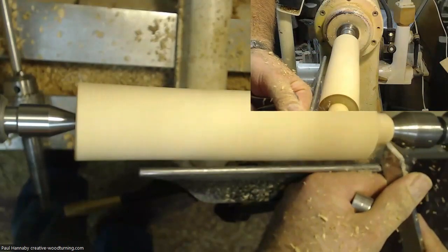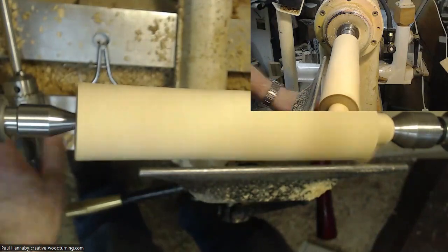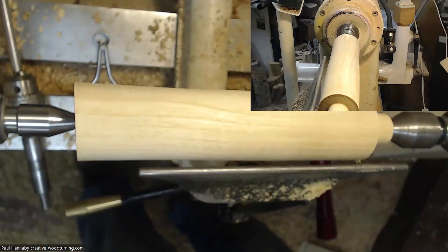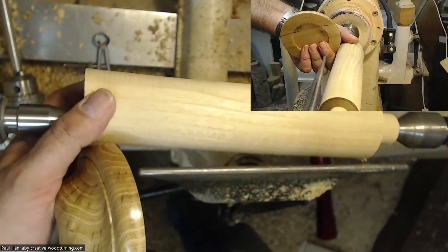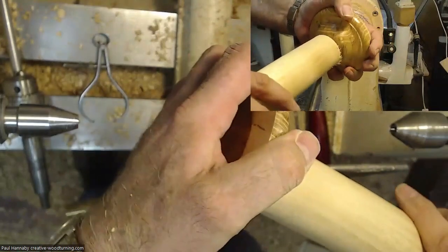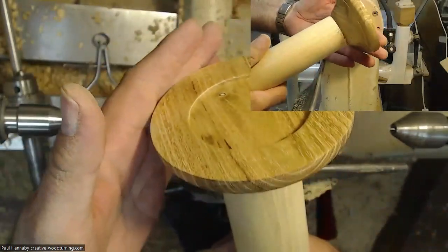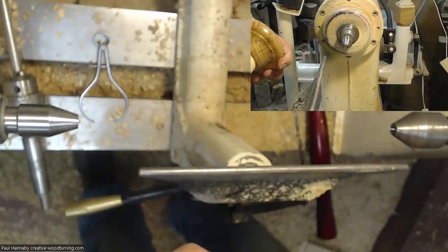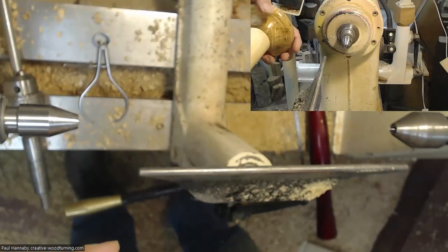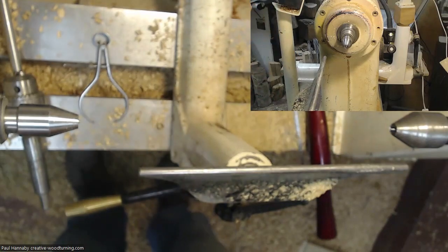Right, and I'll put a little bevel on the end to make it go in a hole easier. And then at that point, we'll measure it. We'll put it up against the base. So I can slacken that off, take my piece of wood out, and check the fit into there. Now that's perhaps just a little bit tight at the top end, but it's just about gone all the way in. So now I've put it in once, I've compressed the fibers on that spigot. So next time it might just go in slightly easier, but I think I'll just ease that just a little.